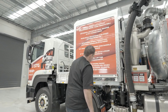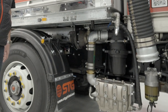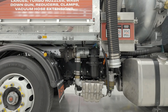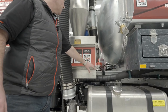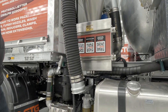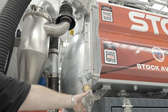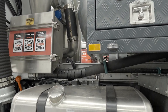Looking down here at the jetter pump — all the hydraulic fittings look in place. It's important not to be pulling on hydraulic hoses or fittings as they're often under pressure, but to the naked eye it all looks good and tight with no hydraulic fluid underneath, which is a good sign. Moving through, the cyclone separator is done up nice and tightly and won't swing open in travel. The boom is stowed away, the vacuum tank is correctly stowed in the brackets, cones are on top of the cyclone, and caps are locked on cam locks with the safety chain. Fuel caps are on as well.